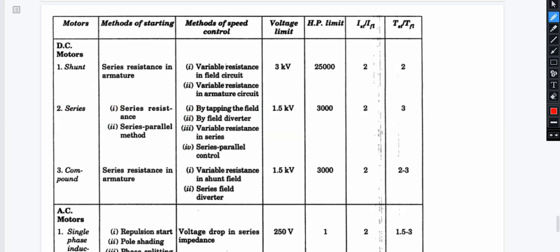This high starting torque is a very important advantage, making series motors suitable for high starting torque applications. Next, we have DC compound motors. For the DC compound motor, we use series resistance in series with the armature. For shunt-series compound motors, starters used include 3-point, 2-point, and 4-point starters. Speed control of compound motors uses variable resistance in the shunt field, series field winding diverters, and simultaneous methods.